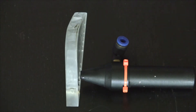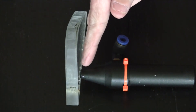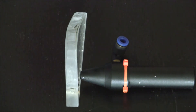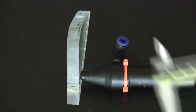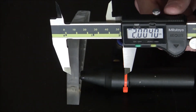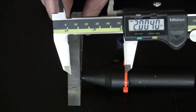A couple of considerations with this is that the air will not be able to flow out of the tip as easily. The 2 inch focal length really isn't the best lens to cut this material, but I want to do a thorough number of tests to see what the 2 inch focal length lens can do. If I put the nozzle right at the surface of the plexiglass, the focused laser energy would be about 75% of the depth into the material.